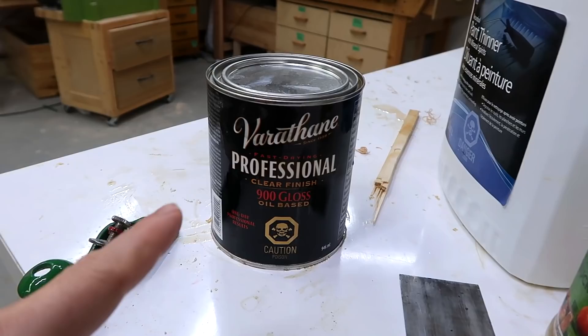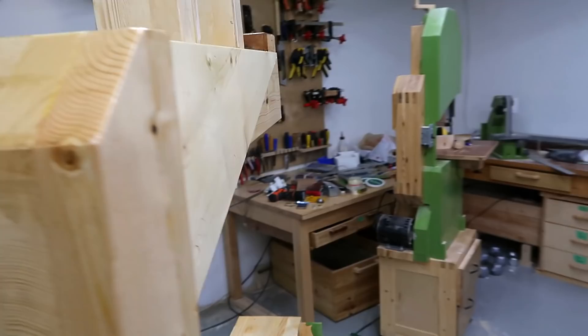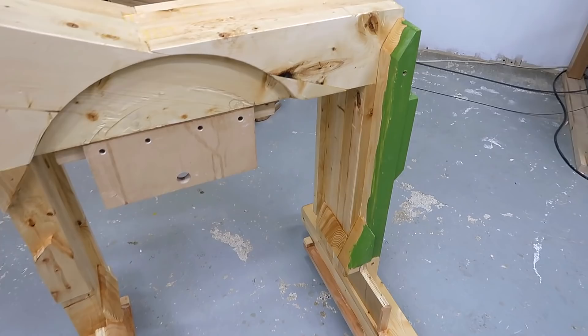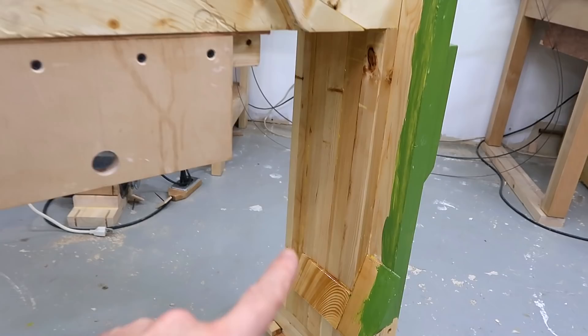I finished painting and varnishing the enclosure of the bandsaw a while ago, but now I've just put the second coat of varnish on the frame. I'm using an oil-based varnish because my main concern is to slow down how fast moisture gets in and out, which will hopefully make this big lamination less likely to have trouble, because it's very vulnerable to moisture changes. It's also very important to have varnish that resists moisture on the bottom, because if I'm milling some kind of raw log the sawdust that comes out is really really wet.